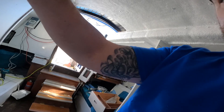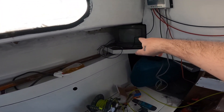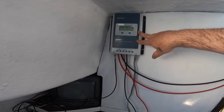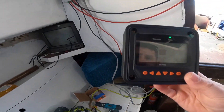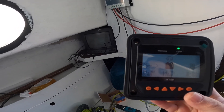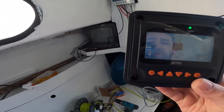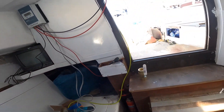There's another good thing I've done — excuse the mess. I actually got some power going through the system yesterday. The old TV is a 12-volt old-style television which works — I was shocked. I've got a new solar charge controller, an MPPT one, installed, and a solar panel. I'm actually getting 39.3 volts coming through the solar panel and I'm charging the battery at the moment — it says it's fully charged at 14.7 volts. That's only attached to one battery so I need to connect it to both.